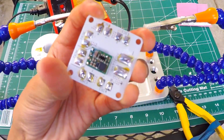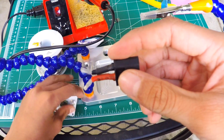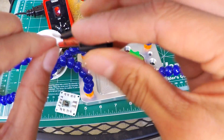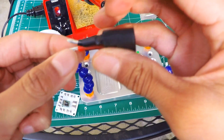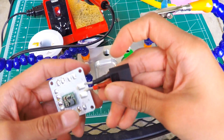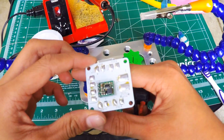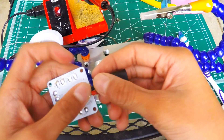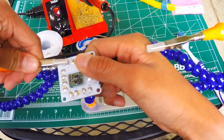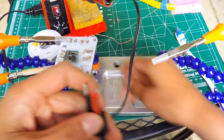Now we can start soldering on the XT60 pigtail. What you want to do is cut the XT60 pigtail down very short — see how short that is — then strip the wires and twist them. By twisting them you're preventing any air bubbles, and air bubbles are basically flaws in the solder joint. Make sure you check — you can put your PDB onto the frame itself, solder on the pigtail, and test fit it first to see if the battery can plug in easily. Once you've done that, you can solder it on. We need to put solder onto the wires first.